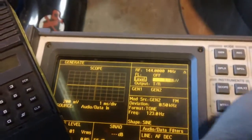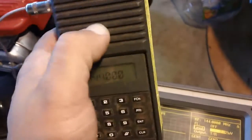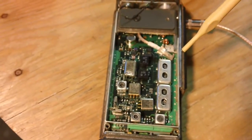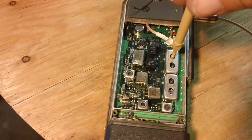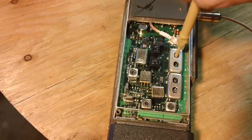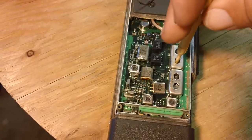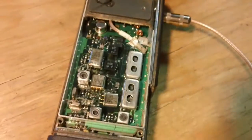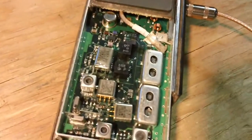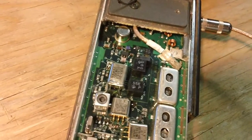It's working really well — I'm just pumping in more power and I have amateur station signals going into the radio. I need to pump in the signal and tune it to within industry specs. These are the receive tuning slugs for the radio. I'm going from one end, going by ear — I know what it sounds like when it starts to get better or worse. It got way better — nice and clear. Reducing the signal: sounds like it's within specs. That's 0.25 microvolts in, about 12 dB — industry standard. This one is tuned up and ready to go out the door.